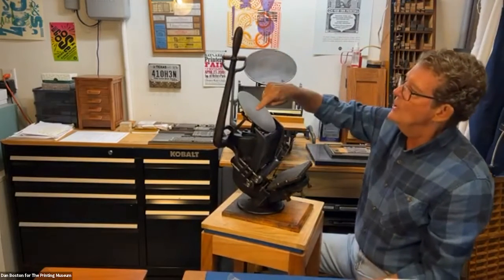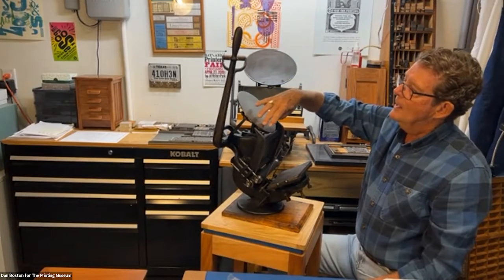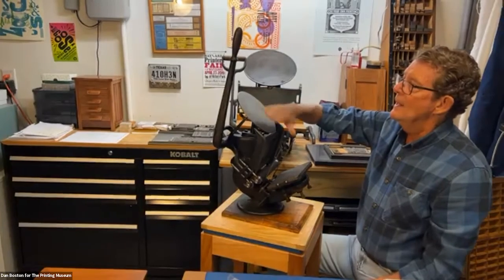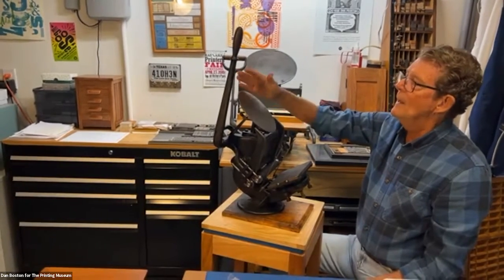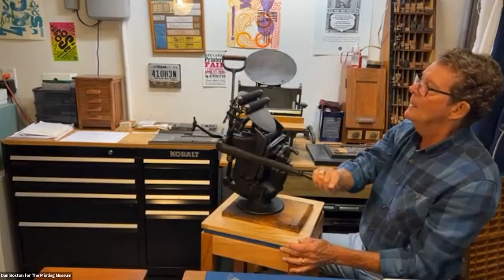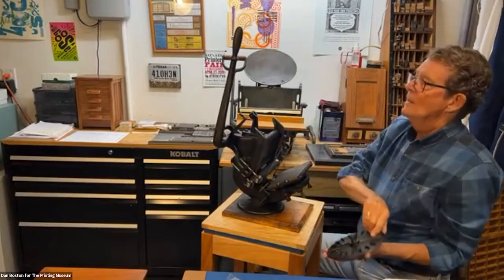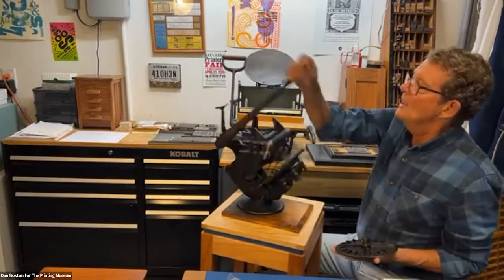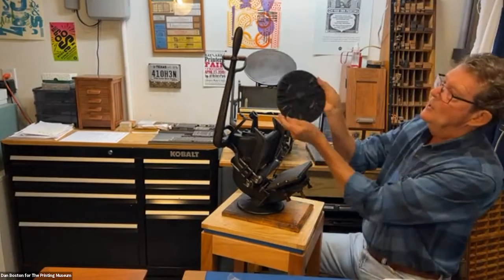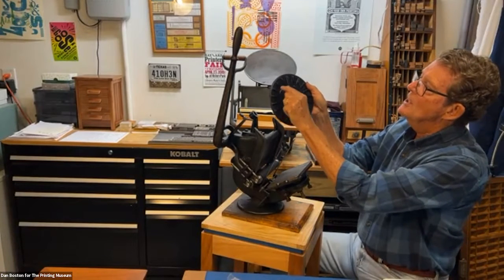The third thing, did you catch that disc moving? The ink disc has to rotate so that the ink is evenly distributed and evenly taken off the disc. And I'll do it again. There we go. And I just took it off. You see the little hammer or pawl back here? That fits on or pushes against these little teeth.